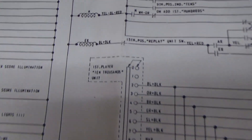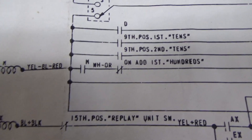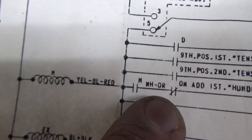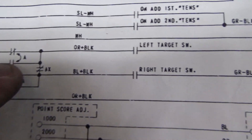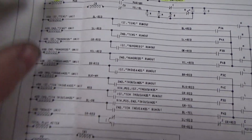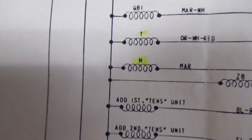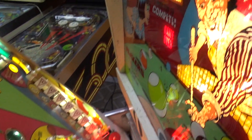So what pulls in the H relay? One side is connected to the transformer and the other side can be pulled in through all these different ways — there's a switch that says H, so it can be held on by a switch on itself once it pulls in. It can also be held on through the A relay. That's the M relay — it just looks like an H. They had highlighted the H relay — they're on the trail, they're figuring it out. That H relay isn't coming in. If I push in the H relay very carefully with my fingers and the tilt light goes off — uh huh. Now we're getting somewhere.